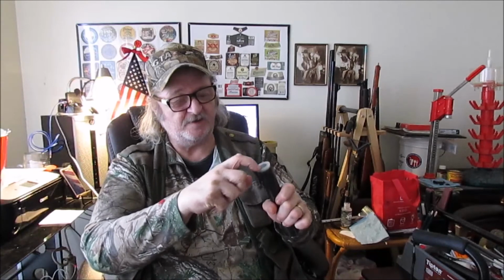And this taper down in there, the part that goes like that, has some silicone lube on it, but that thing still turns around there pretty tight. Not quite as loose as the one that had turned red, the reddish orange from before. So next time we'll start putting her back together, get the action back together, and then we'll remove the shroud and strip, polish and re-blue that. So stick around, it's going to get done.